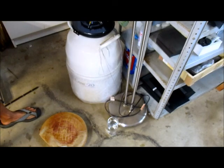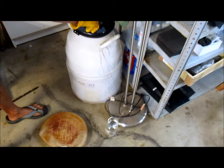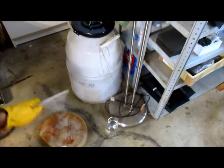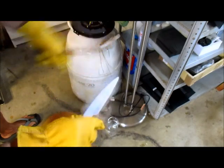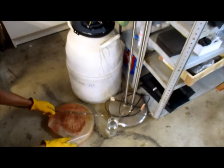Okay, it's done boiling. That means the whole blade - because I laid it down - is at minus 195 Celsius. When I take it out, the temperature rises a little bit, but the transition temperature for this steel is about zero, so this is way too cold. Alright, I'm going to do a quick whittle, and then I will do a quick chop.